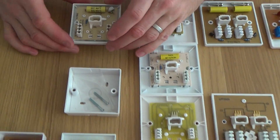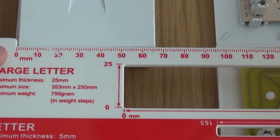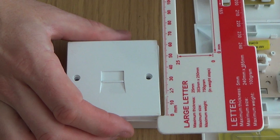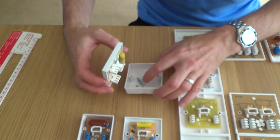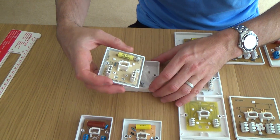The two series are smaller — 65mm by 65mm — and they come with a back box for surface mounting. So if you're placing a socket just above or on your skirting board for surface wiring, you'd use the two series, fitting the included back box before attaching the front plate.